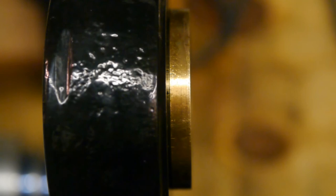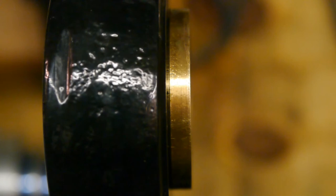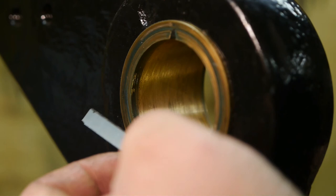Disassembling the spindle pushed the front bearing forward again. I wonder if I should pin the bearing — drill a few holes through here and put in some grub screws — because every time you disassemble or hammer out a tapered arbor you risk moving the bearing forward, and over time it gets looser and looser. I'm going to scrape off this green stuff using a box cutter knife.